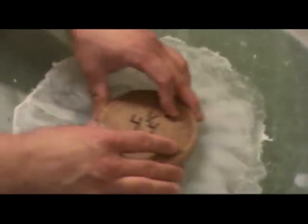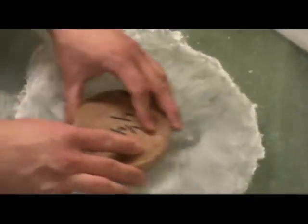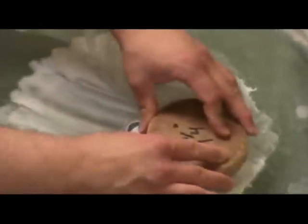The same way I can adjust the length of the stroke. If I take a short little stroke the action isn't getting away any farther from the center than the edge of that stroke. But I can lengthen that stroke out and that puts some action out there several inches — four or five inches away from the center of the mirror.